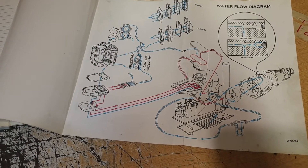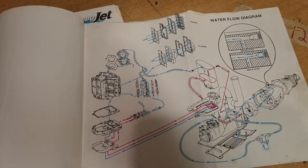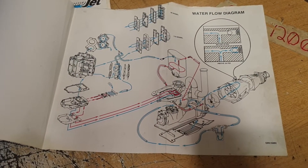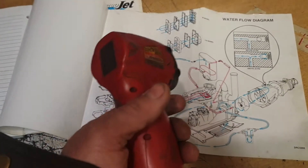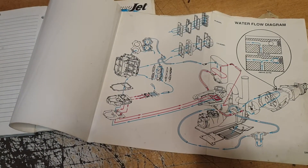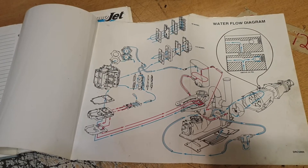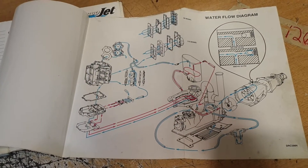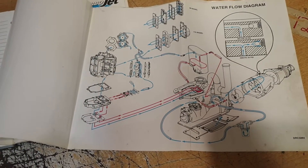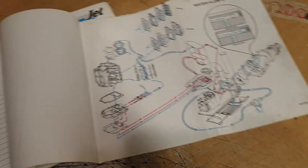Don't put any more hose to it — just get the engine running and take it to the lake, because these engines notoriously run hot if anything is plugged. If something is plugged and water isn't flowing right, the engine will sound an alarm telling you it's overheating. With a thermometer you can check the temperature while running — you really don't want it to exceed 200°F. Around 180°F is the normal operating temperature. When it gets to 200–210°F the overheat buzzer will go off and you need to shut the engine off.